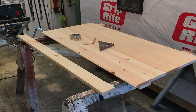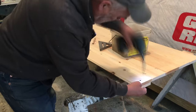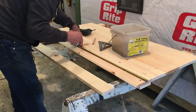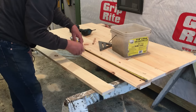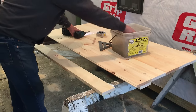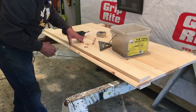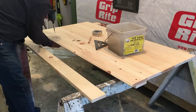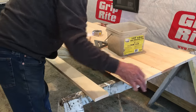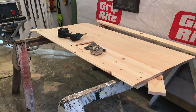I have inch and a quarter screws. 28 inches is about the center — I want to stay away from there because I'm going to be cutting it in half. I'm not too concerned about placement of screws right now because I'm going to put another 2x on top. So it will actually be a two and a quarter inch thick door — should be really stout. I've made a mark at 23 and 5/8 here and put a line down so I can tell from underneath.